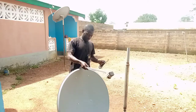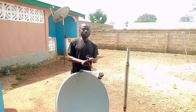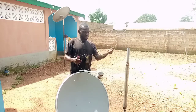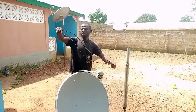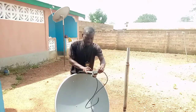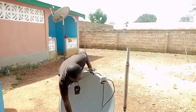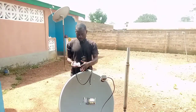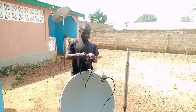As the fixing of the dish is done, it's done with the tracking of the two signals, which is 45 degrees and 42 degrees. As you can see, I have my cables here — my quadra cables, neatly arranged. I put my first primary LNB cable in, and then this second one is my secondary LNB, which is going to be for the 45 degrees.